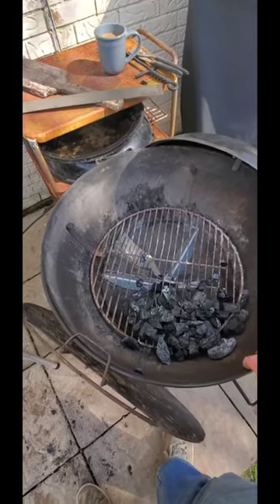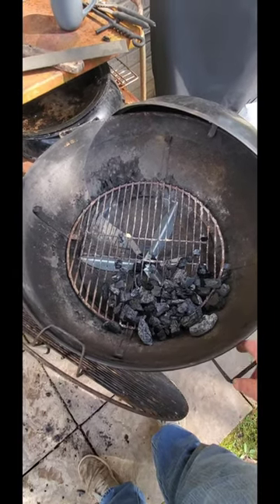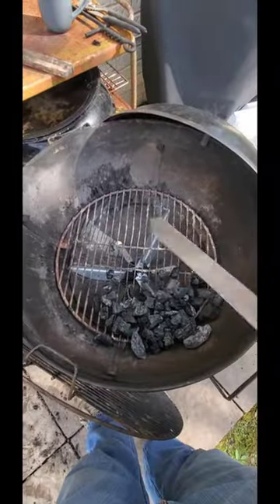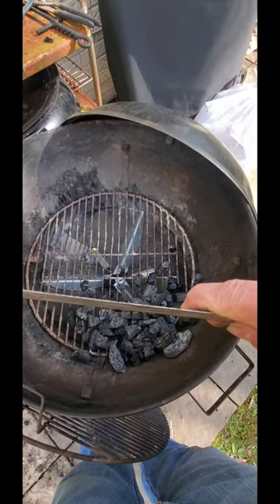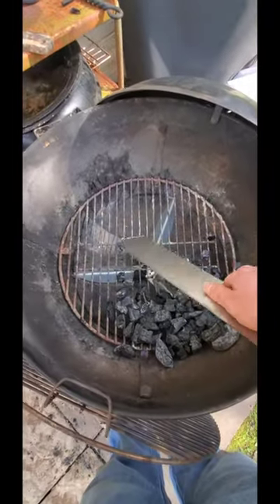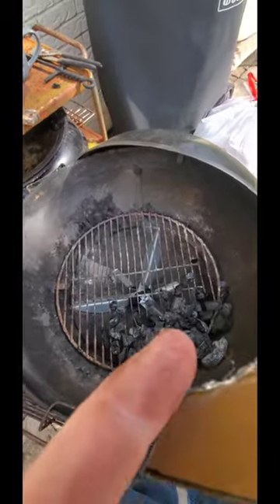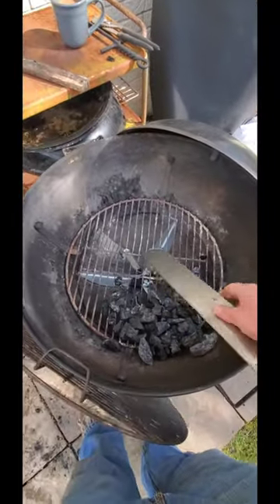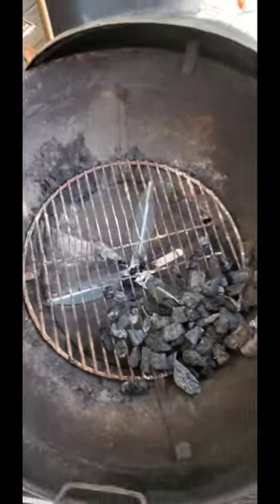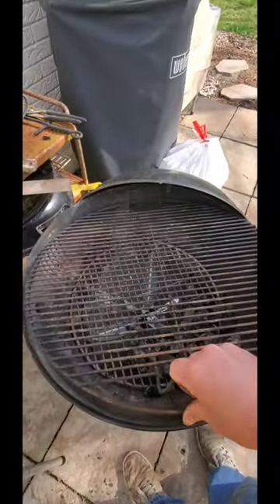One downside — when I was trying to weld that little piece back in at the bottom, the metal on these grills is so thin it's really hard to weld, you just blast right through it. Any time I need to weld on these, I've found you just get a thin piece of metal — I don't know what gauge this is, but it's floppy — cut a piece off and weld on top of it. Grind it down, put your piece on top, and just kind of weld on top of that piece and it'll stick through to the metal underneath. That's what I had to do on the bottom.